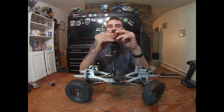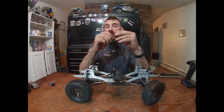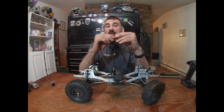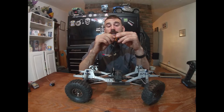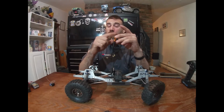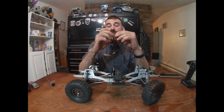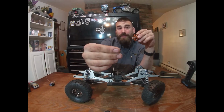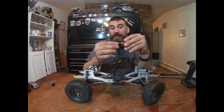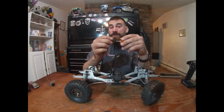So I throw my pinion gear on and tighten the grub screw down. I didn't feel anything funny. Then I couldn't get the grub screw out. It somehow rounded off, and I got really worried because y'all know the price of this motor if you've looked. I literally had to drill into the grub screw. Then I had to take my file and file down the pinion gear. Luckily, I didn't have to worry about damage to the shaft.